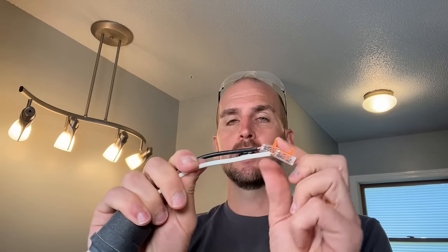Moving on to lighting — we mentioned the vanity light is going from the ceiling to the wall, which gives us more options on fixtures and will look a lot better. I want to remove this light fixture now so I can patch the ceiling and do the drywall work, but I don't want to lose lighting. What I usually do is use temporary light sockets with a 100-watt LED bulb and two-pin WAGO lever nuts — it's super handy. All I have to do is undo the light fixture, turn off the power, get my hot and neutral wires, put those into the two-pin lever nuts, and now I have temporary light. When I'm done, just lift the lever nut up, take the unit off, and store it in my truck ready for the next project.